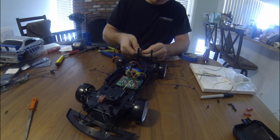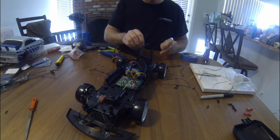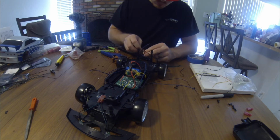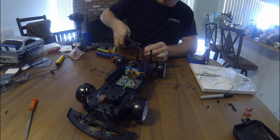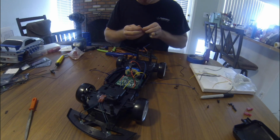When it comes to wiring the underglow portion that's attached to the RC body directly, go ahead and wire them similar to how you did on the body. So just link all the colors together and all the blacks together to get as few wires as possible, because I did go ahead and drill a hole that you're going to want to do as well, in the 11/64 size, on the side that the switch was, on the cap where the switch is located, because the wires are going to have to pass through there.